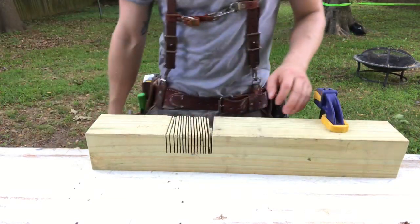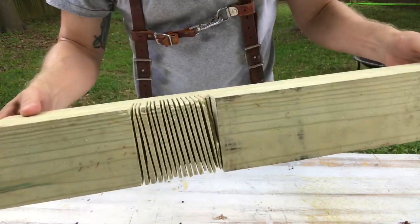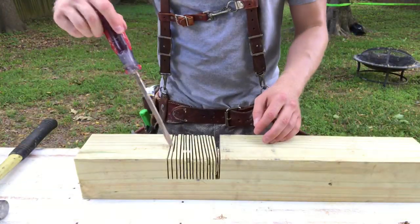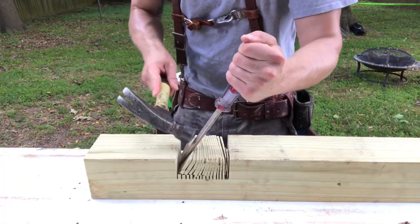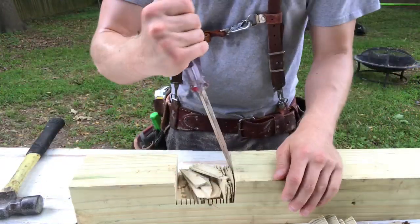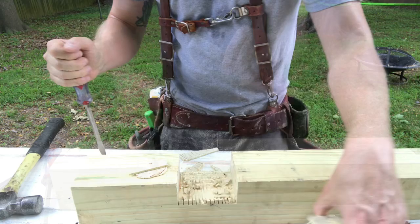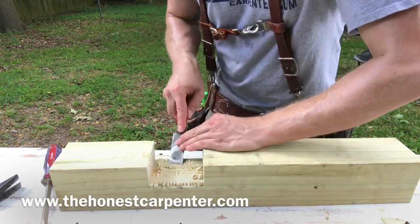Don't feel the need to rush. When all the cuts are made, you have a row of fillet strips standing up in place. Because I've made the cuts across the grain, these strips have almost no lateral strength to them, which means they can be broken out with little effort. I sometimes do this with a hammer, or I just wedge a screwdriver in the last slot and crank it over sideways — it'll cause a domino effect and the pieces generally come out in one big clump. To get a smooth floor to the joint, the best thing is to switch over to a sharp one-inch chisel.